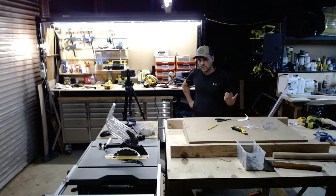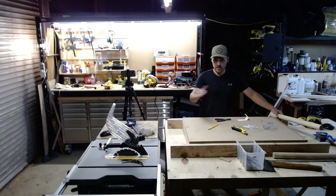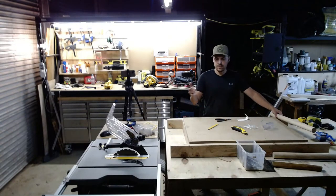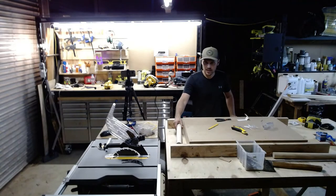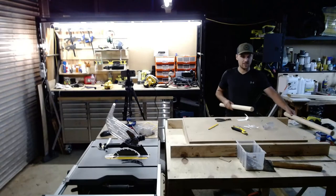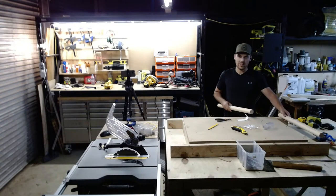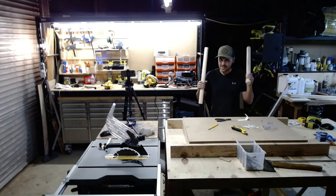So the tricky bit, if you haven't heard it yet, is the rolls. We want to put a conveyor belt over that. So we have to lift up the base, so there have to be legs underneath so that the conveyor belt can travel underneath. But we also have to make it so that we can replace the conveyor belt at one stage. So one roll here will be fixed and there's going to be the motor on it, and it will turn. And this one has to be adjustable, backwards and forwards a bit, so that once the conveyor belt is worn out, we can pull it closer, get the conveyor belt off and then put it on again. So that's the idea.